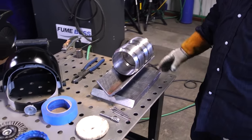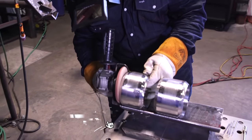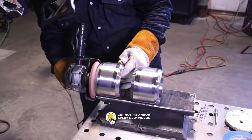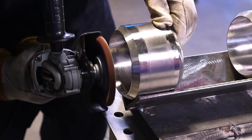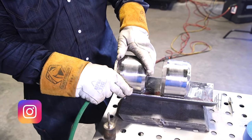We have our pipe coupons here — it's a four-inch schedule 80 pipe, pre-beveled. I'm going to finish prepping these with an aluminum disc. This material is kind of soft and likes to clog up grinding discs, sanding discs, flap discs, and so on. I'm going to put about a dime-size landing on here, just because this material is soft and likes to basically drop down away from you when you're putting in your root.